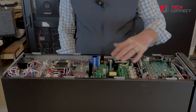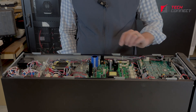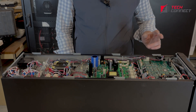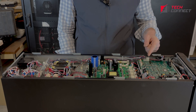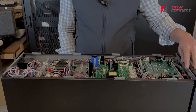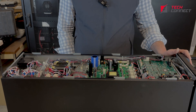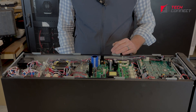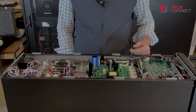Right here, if you open this one up — this power board — it goes down to IGBTs and some DC capacitors. We have occasionally had to change out a control board. Even the display can be removed pretty easily with some bolts. So we really like the way these are designed just because you can get into it — it's very accessible and things are easily interchangeable.